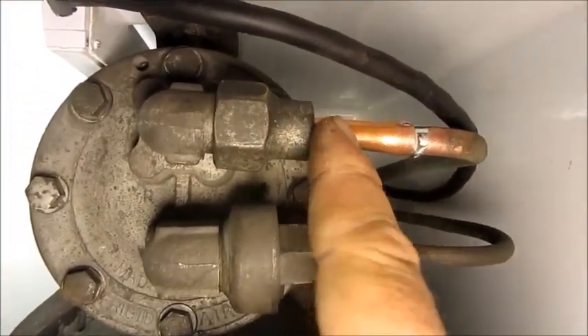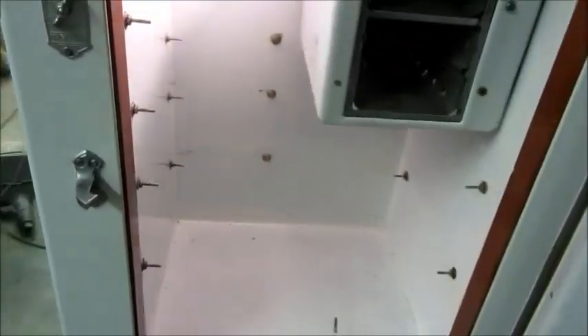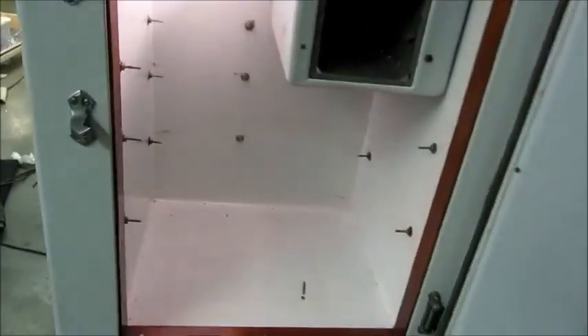This adapter is soldered on, all that stuff is tightened up, ready to go. I put that evaporator cover on there just with a couple screws temporarily so you can see how it provides a shade for the light. The light shines out, hits the white porcelain interior of the cabinet, and shines down — pretty well lighting the entire cabinet up, but without having it shine directly in your eyes. When this is sitting on the floor, people are tall enough that the light is not going to be in their eyes. All the shadows — none of the shadows.